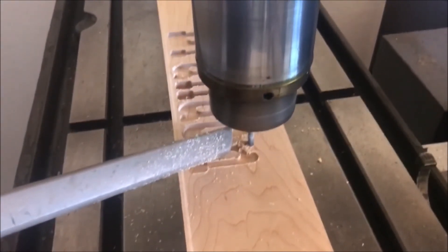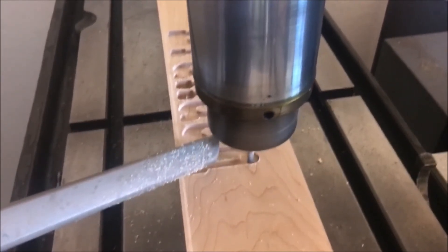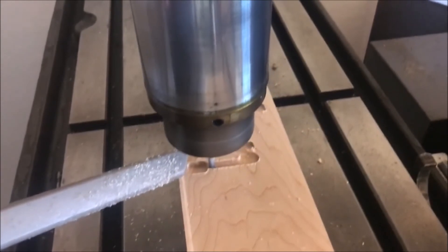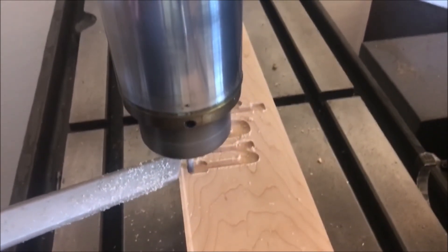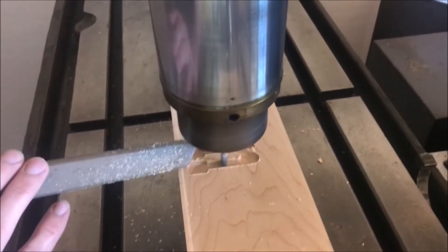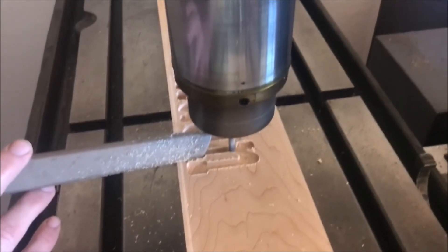And lastly, the oiler pump. I would like that to be turned on whenever the machine is on, and off when the machine is off. Right now, every time I do a cut, I do a manual oil pump to keep the machine oiled. So that's basically where I am.